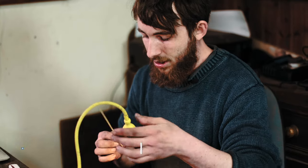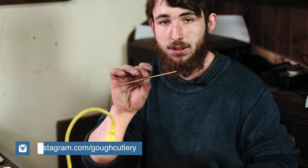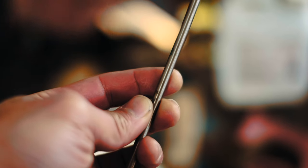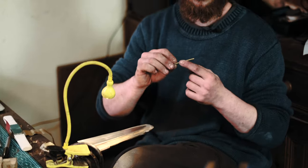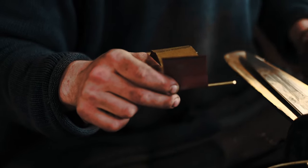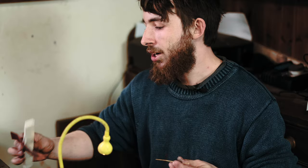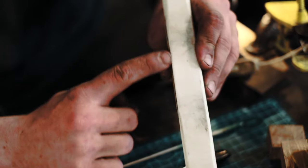One little tip that helps if you've got persistent scratches right up by the plunge line: I actually like to switch to a round bar for that, ideally one that fits inside your size of plunge line. A round bar gives you a much smaller contact point so you can put a lot higher pressure down and really bear down on the deep scratches, then switch back to a flat plate to go over the top of them to actually make the surface flat.